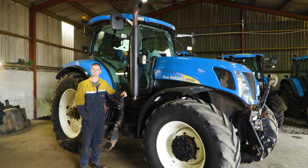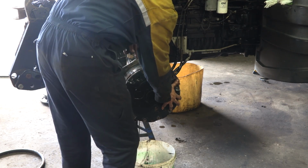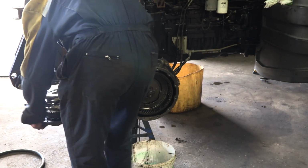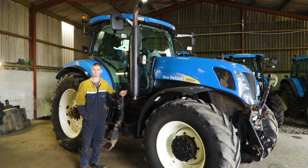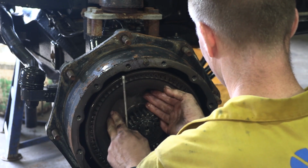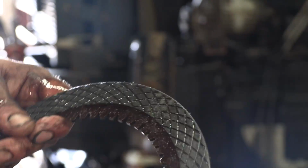And then, on a final note, the front hubs to the brakes changed as well. Is that a big job? It's not something you hear talked about much. No, it's not a big job. It's just basically lifting the front plate off the hub, and it's just in there behind the plate. A lot of people wouldn't really know that there's brakes in there unless they're told, and they maybe get overlooked a bit. But now we pulled the brakes out, and they were starting to break up a wee bit, so replaced them, new oil in, and that was that done.